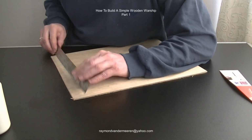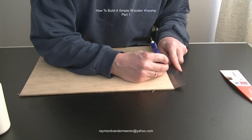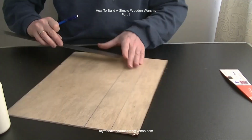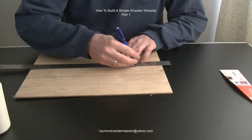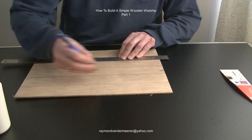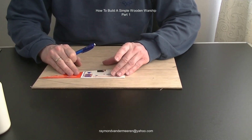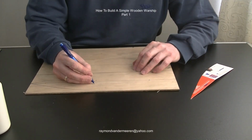Then we draw the lines for the bottom of the ship. As you can see, the plywood is not long enough for the whole length of the ship. Sometimes we have to use what we have and make it in 2 or even 3 pieces. As with the deck, we also draw a line precisely in the middle of the beam for the template. Again, use the cardboard template to draw the correct lines and flip it over to do the opposite side. Number the pieces.